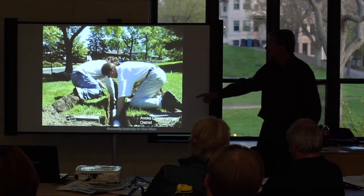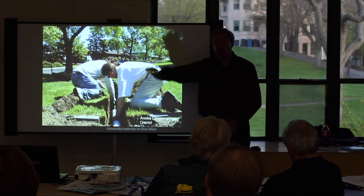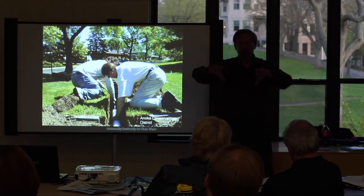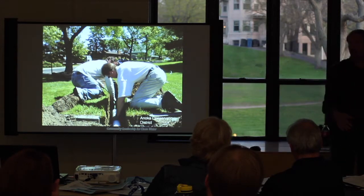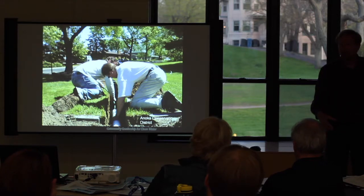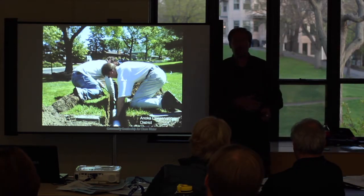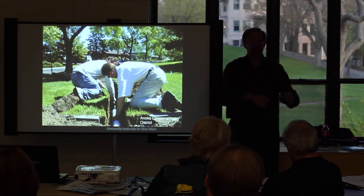Once you have it set up, you take your garden hose and put it all the way in against the dirt. You turn on the garden hose full blast, and you wiggle the pipe. And the pipe moves. And 15 minutes later, it pops out on the other side. Okay? You will get muddy, but that's half the fun. That mud has to go somewhere. It comes out the back end as well as pushing around the pipe. And that's the lubrication that gets it to move.